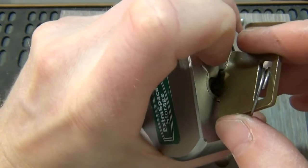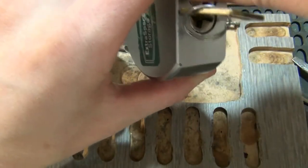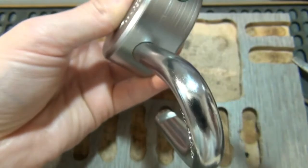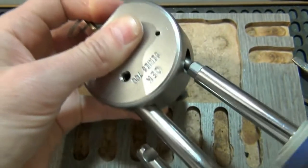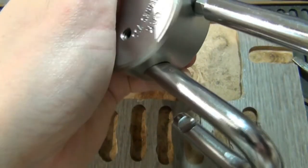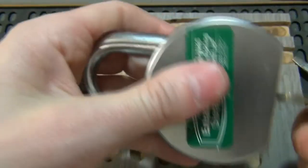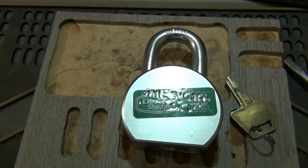I just need to get the lock unlocked, so I'm holding the bottom plate on, unlock it, and leave the key in. If it's not key retaining you don't really have to do that particular step. Drop our nut in there and our screw, and tighten it down. Like I said in other videos, you don't want to tighten these too much because you can actually shear the screw off — just snug it in there. Now we lock it back, turn it, our key should come out, and test it. It works perfectly. There's a video on just reassembling a 700 series American padlock. Thanks for watching and I'll talk to everybody later.